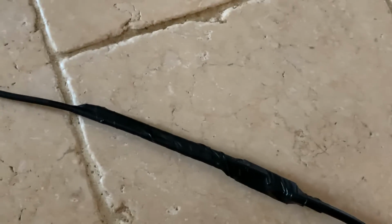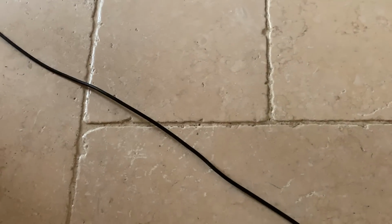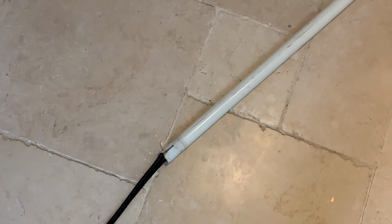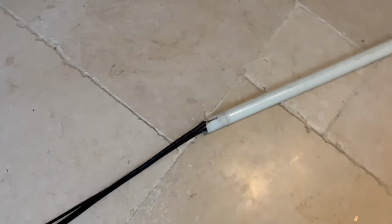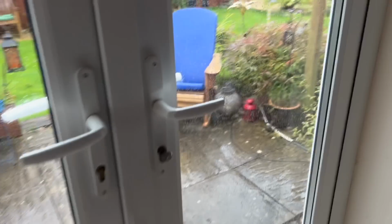Just continues up. That then goes to our inline coax capacitor and then continues on up on a single bit of wire for 3.45 metres. Right, so what I'm going to do now is put that inside of the High Gain Master's skeleton and put it outside, stick it up, and we'll see if it SWRs, fingers crossed. It started to rain, so I've got to be relatively quick.